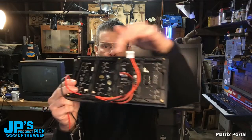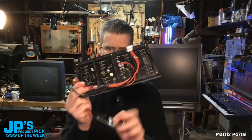But you don't probably have the room for a whole billboard, so we allow you to do one, I think up to 4, depending on the number of pixels of the displays, connected using a ribbon cable for data. And then of course you've got to pass power around, and there are some jumpers to set on the board to do that 64 by 64 height, and then you can go wider with that. So we have some libraries that show you how to do that.